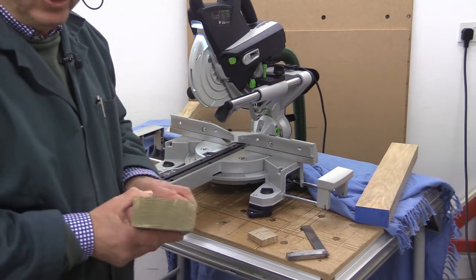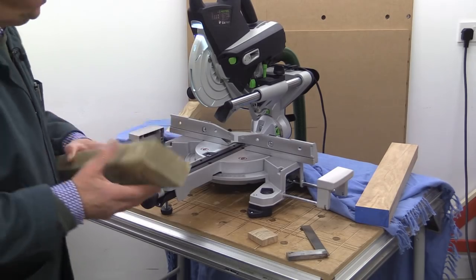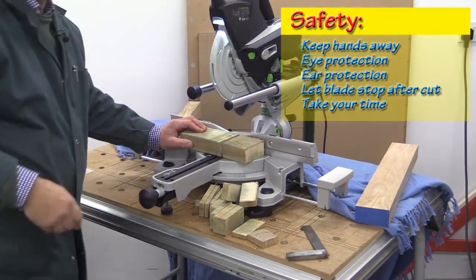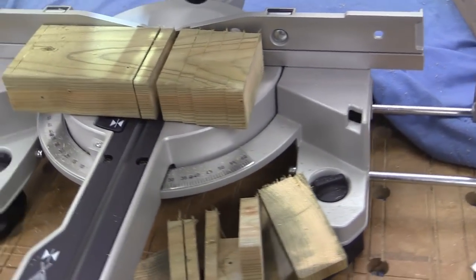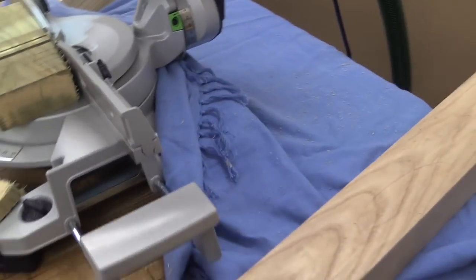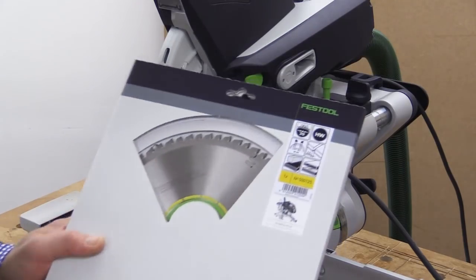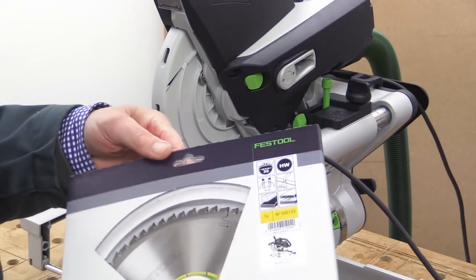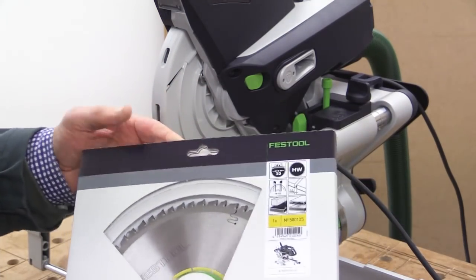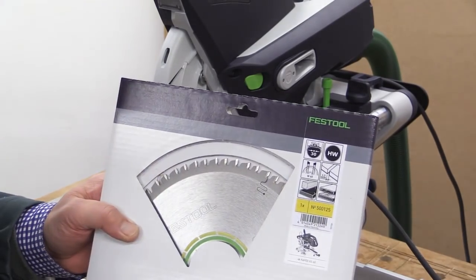In the interest of checking out the dust collection, I've got a piece of 4x2. I've put a blue cloth at the back and I'll bring the camera around after doing a good number of cuts. Looking around the front of the machine, there are some little bits of dust — nothing of any great shakes. When I was cutting, there was no dust in the air. What we're looking at here are chippings, and there are more on the right-hand side than the left. This is the W60 fine-tooth blade — 60 teeth — very much the equivalent of what I use in my KS120. This is the blade I'd keep for all my cross-cutting, and I think we'll see a considerable improvement in cut quality compared to the universal 36-tooth blade.